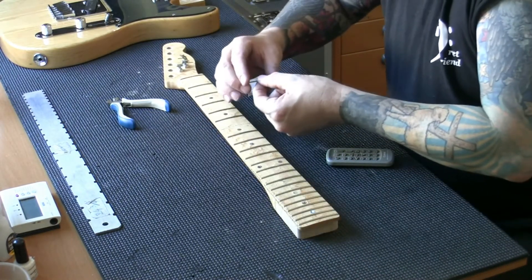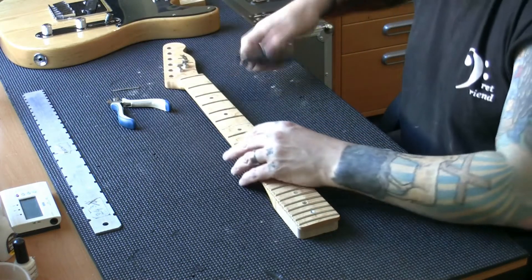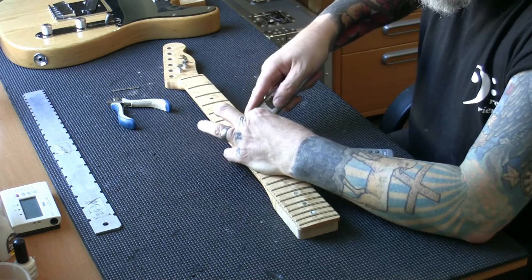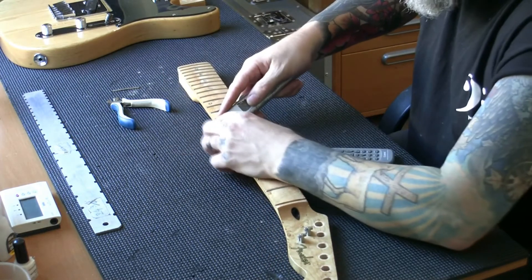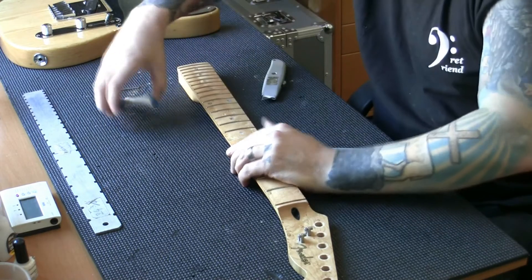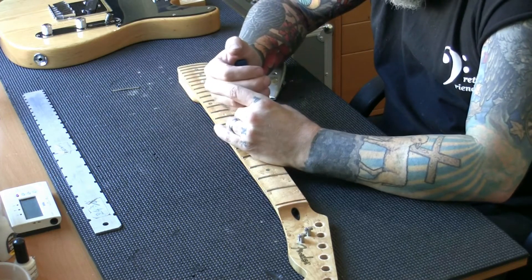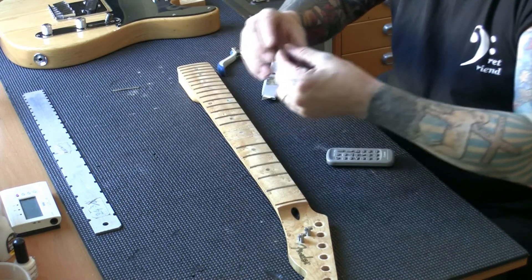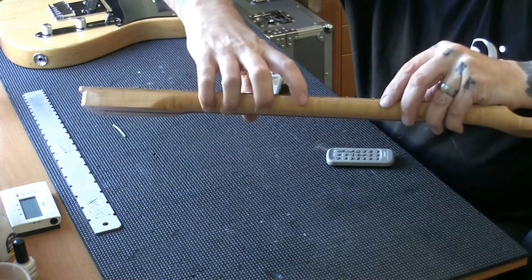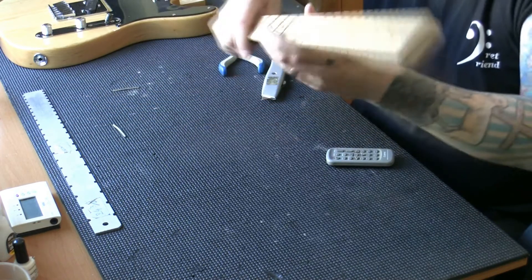What I'm going to do is nip the tangs off the edges of these frets - if you see here, these edges are just nipped in. I'm going to do exactly the same. I'll show you how I remove one: score just inside the fret in case there is any glue there, turn it round, score this side, and that should stop me getting any chip out. I'm going to try and just get under the fret without damaging the fingerboard. Can you see that - the tang is just inside there. We've not broken through. So I'm going to fit the frets inside these. I should be charging an extra 25 quid for that but I've already quoted a price, so I'm going to stick to the price I've quoted.